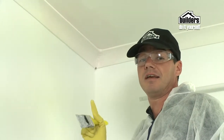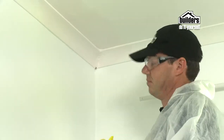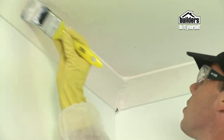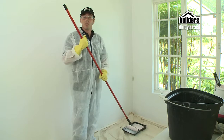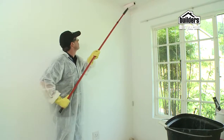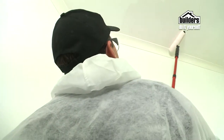Don't panic about the pink ceiling — as it dries, it will turn white. Cut in the corners all the way around the ceiling, and don't worry about not covering everything because you're going to do a second coat. Now we've got the easy part. We've got our paint on our roller and our roller pole — you can stand back and just roll the ceiling. A thin coat will ensure there are no drips and runs. Work from one side to the other, walking backwards to avoid any splatters on the already painted surface.